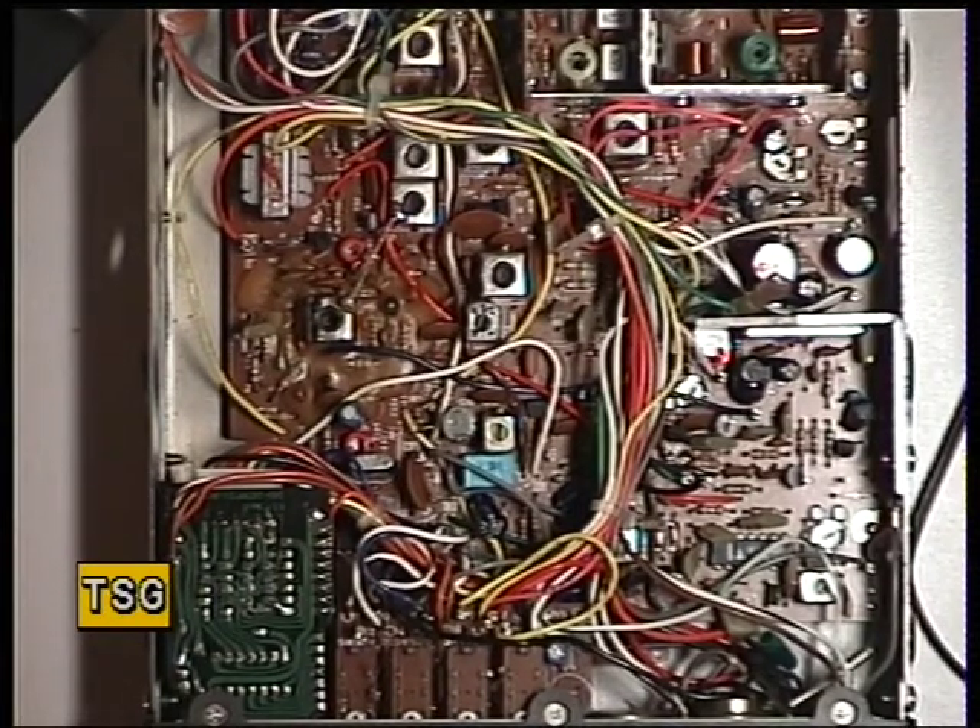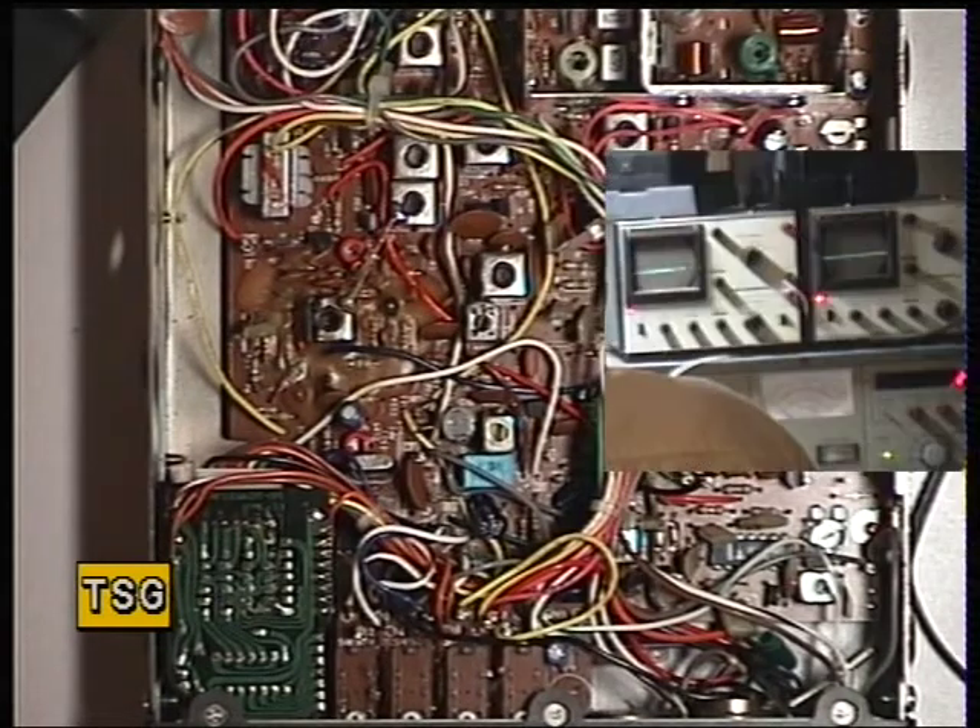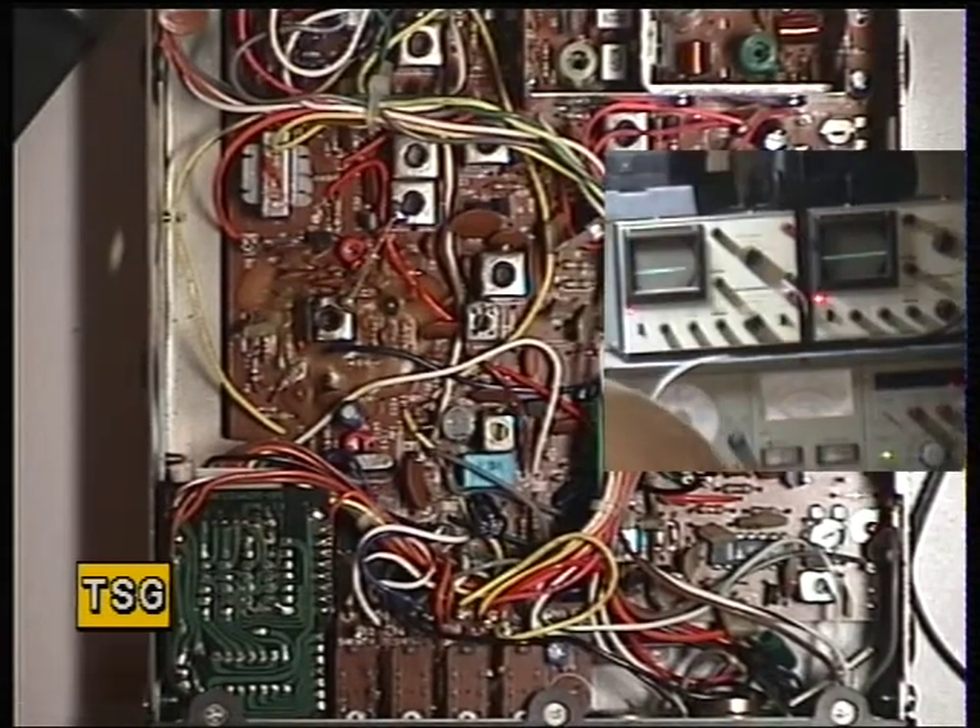The first thing we do is transmit. I'm just going to switch so you can see the test set power meter. We've got the power meter on the 3 watt range, and because this radio has been messed about with so much, we're going to have to go through everything. If I just select the other camera, you should see the test instruments — picture in picture, there we go. Now I'm going to press transmit.